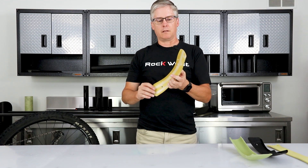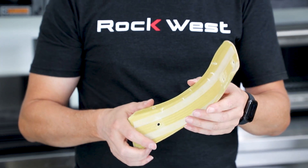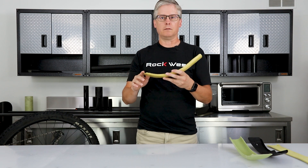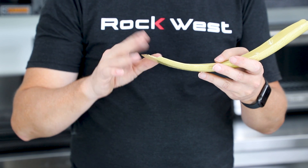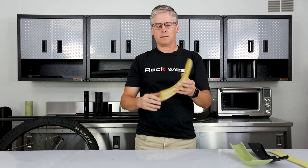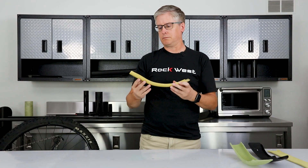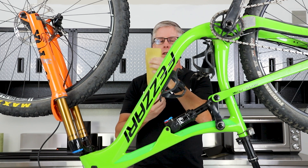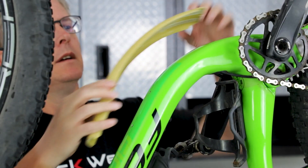The finished part isn't as perfect as I'd want it — after taking it out of the bag it had some sharp edges and edges that needed trimming, so I trimmed it and fixed the edges a little bit. One of the problems with Kevlar is that it frays quite a bit when you cut it. One way to cut down on fraying is to use super glue — put super glue on it and then wet sand it, and the super glue will hold the fibers and cut them instead of fraying them. The cutting tool I used was a simple metal cutoff wheel — the brown or orange fiber wheels. I also drilled the holes out; a regular drill bit works but does leave it frayed, so I used the super glue trick and a file to get the holes just right.